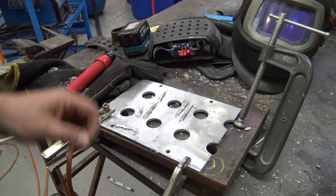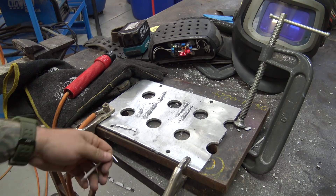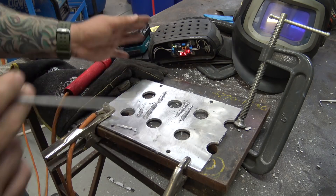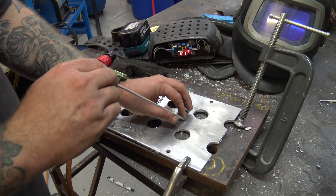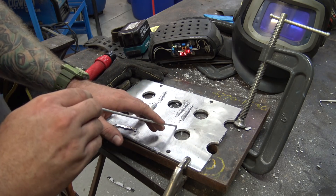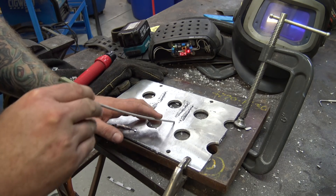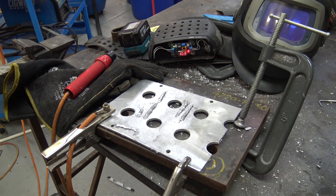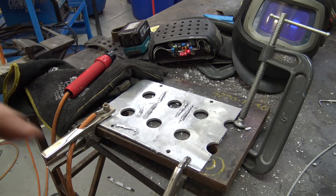The more I preheated, the better I was at a lower heat. Preheating — if you do not preheat, you will have a world of hurt. That is one thing you have to do. I learned this doing the brazing and then learned the exact same lesson again here. Normally with steel I'd just smash the arc in and run the weld, but with these you have to lightly scratch start it first, then once the arc starts you're moving fast and just lay it in. This might be terrible advice — but this is what I found using only 10 rods.